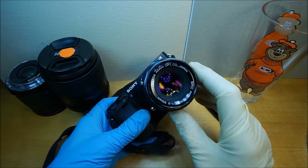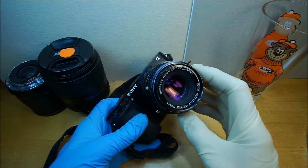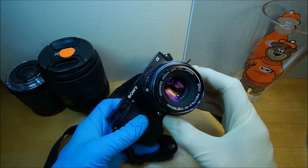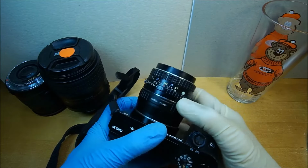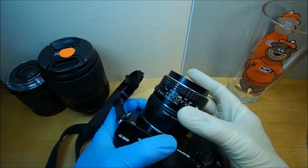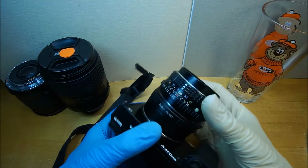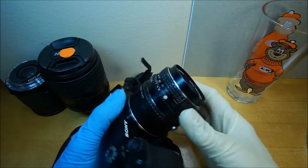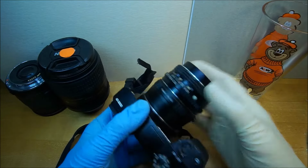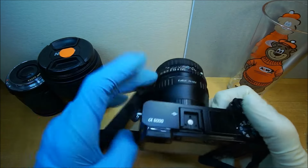But if you look, the optics are beautiful. Can you tell that element is convex? See how the light bar is convex, how it performs? So that's a typical convex lens. It's super clear. If you look through it, the optics are clear. It was in excellent shape mechanically, except for that mark there, and the fact that the focus was almost unusable. So that's why I had to tap it. If it was squished here, I had to tap it here or there to try and bring it back into round. And I was really rapping away on it. I made a video about that, but it sat fallow for a long time.